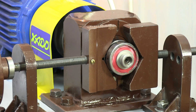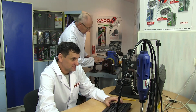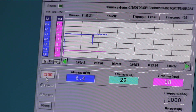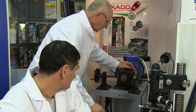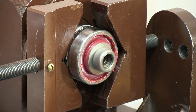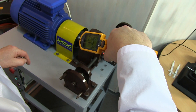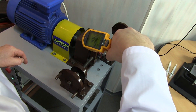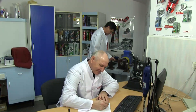Let's start the machine. Now each bearing is under severe radial load of about 8,000 N. Rotation frequency is about 1,000 RPM. During the machine operation, restoration of the bearing takes place — the defect is eliminated by formation of a ceramic metal coating. We constantly control the temperature of the bearings so that they don't overheat. Under the specified load and velocity, the coating can be formed within 8 hours, but we stop our machine after 5 hours, before the end of the treatment.